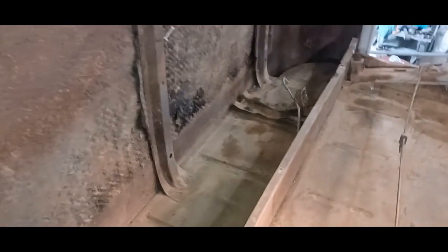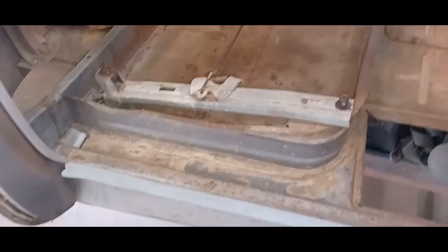Okay, so here's a big ass pile of dirt. That's what was jammed into the cab corner pockets on both sides. And that's why it rotted out. It was probably wet mud at one time. Anyway, I used the shop vac, vacuumed it up. I'd be willing to bet that this floor is in better shape than your 2015 Silverado or F-150 sitting in your driveway right now. It's friggin' mint. A couple holes to patch where the fuel line went out, the factory hole.